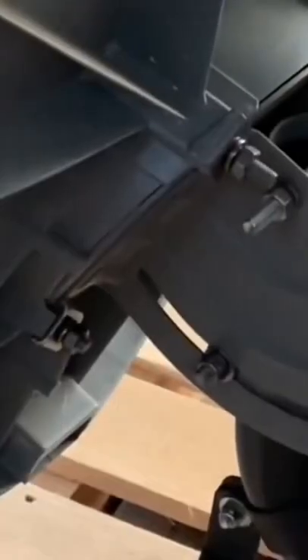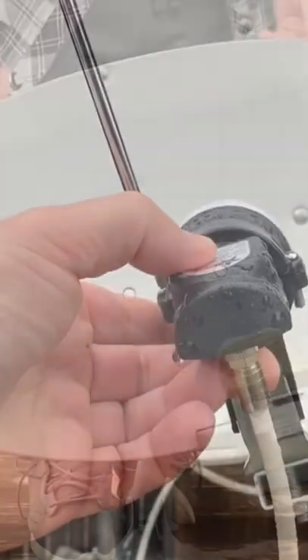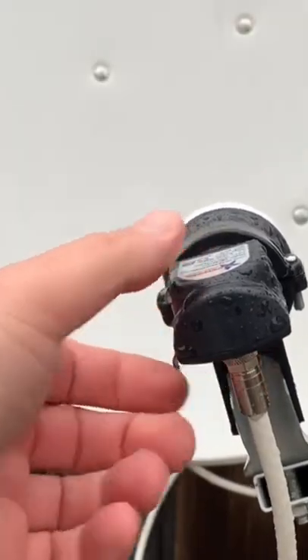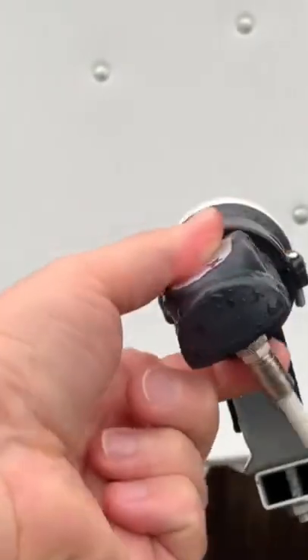Next, I'm setting the rotation angle known as the skew. This is the rotational angle of the LNB, and when you are adjusting this for satellites that are further east or further west, they're going to have a sharper rotational angle. Normally, on a KU band dish, all you have to do is loosen the screws for the LNB clamp and turn the LNB.